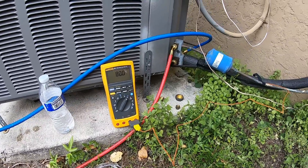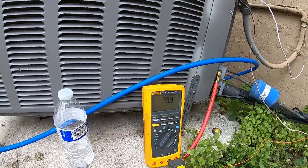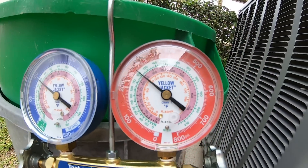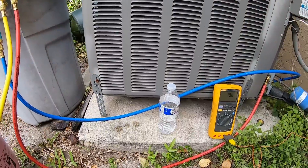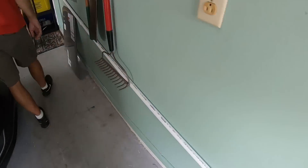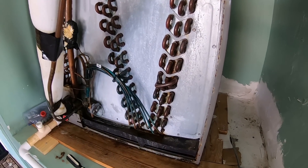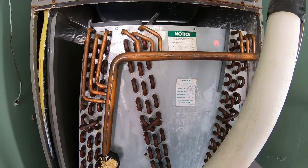We've been at this for a while. I'm charging slowly — we've got about eight or nine degrees of sub-cooling right now. The liquid line temperature is 79.8 and it's been going down a bit. I'm trying to get it to about 12 degrees. The ice is gone on the coil — all melted — so we're getting to where we need to be. I'm sneaking up on it carefully so I don't overdo it. Still got to find the leak in this thing though.